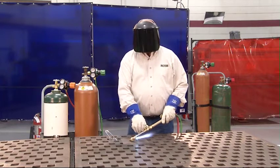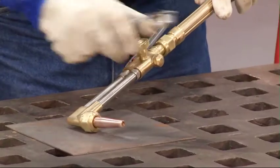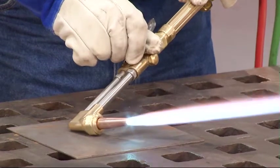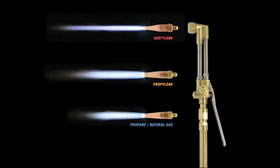You'd use the 45-degree angle technique in windy conditions outdoors or if you have a fan blowing on you. The third way is to open both valves about a quarter to a half a turn and ignite the flame, then walk it up to the desired heat. You'll notice the characteristics of this flame are quite different from acetylene.